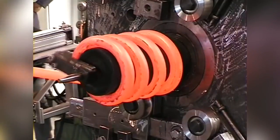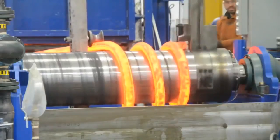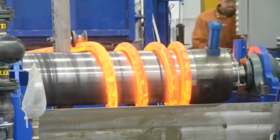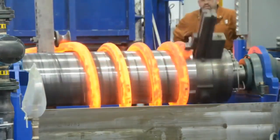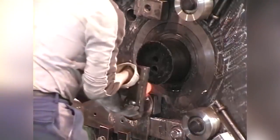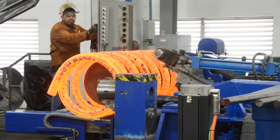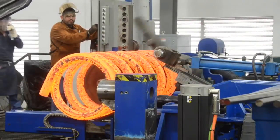The equipment is fully automated. The machine adjusts the internal diameter of the spring; for this purpose the drum is replaced, along with the number of revolutions and the distance between them. The workpiece is fixed on the drum and passed through the rollers of the stepping mechanism, which controls the inter-revolution distance. The rotation of the drum and the feeder is synchronized.